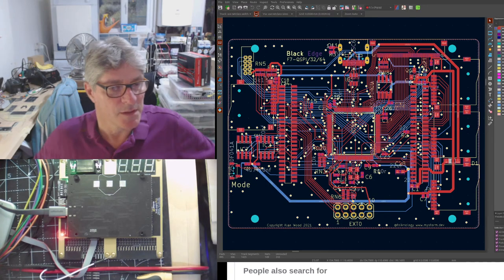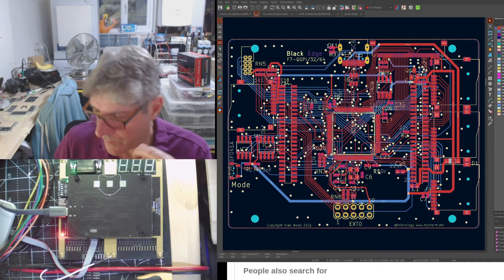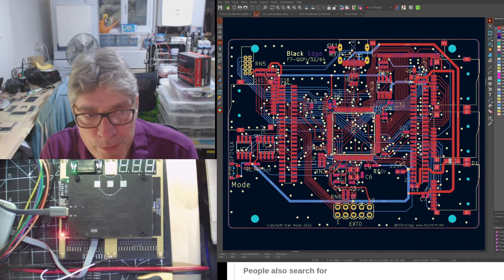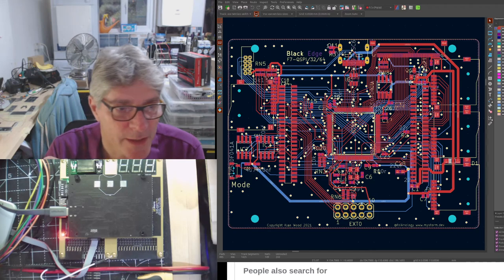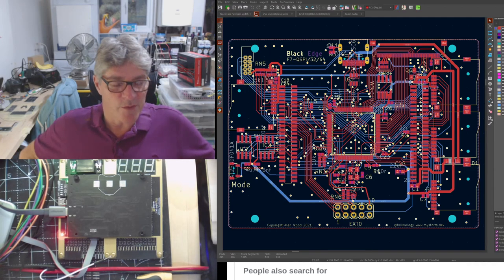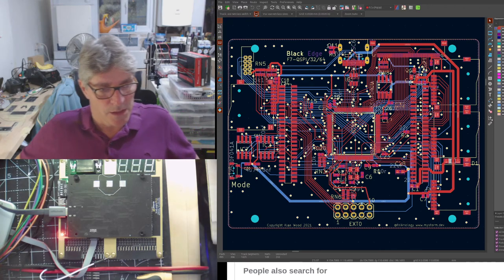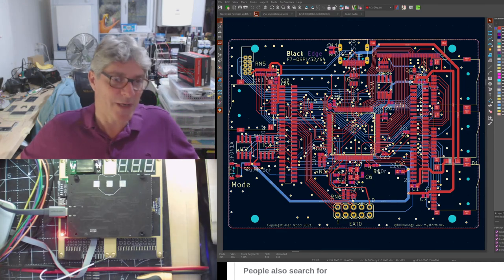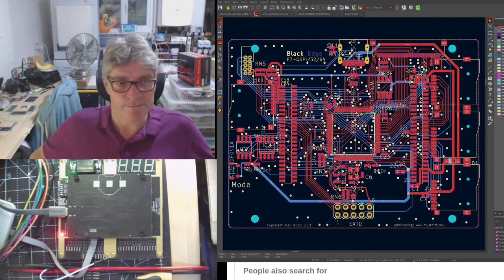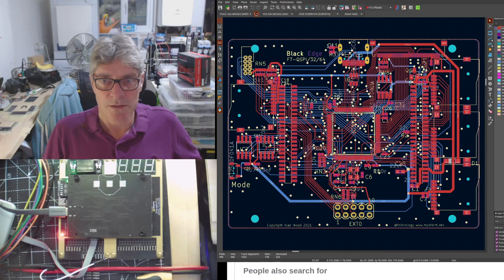Just a short recap on what we covered earlier. No, it's not the memory that will program the FPGA on boot. It is just a different choice. You can either go with Hyperbus flash and RAM, or you can go with QSPI flash and RAM. And on the QSPI, you only get 32 megabits, not 128 megabits of flash. It's for the lower cost version. But they are identical in all other respects, basically.